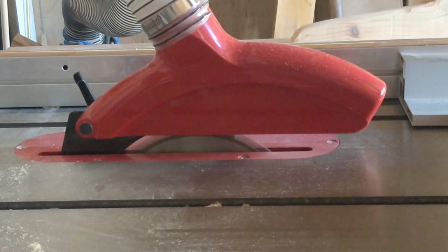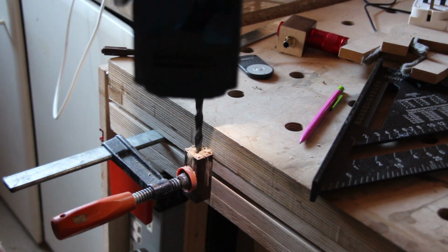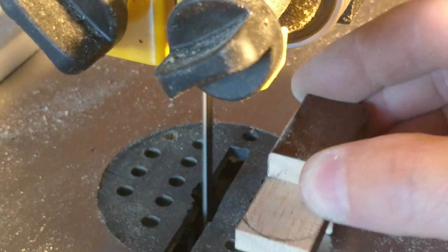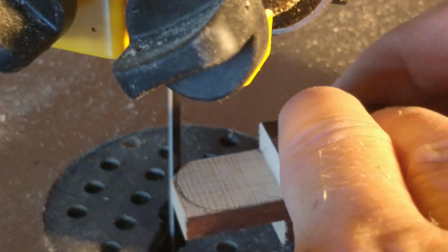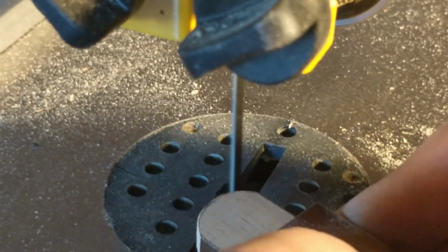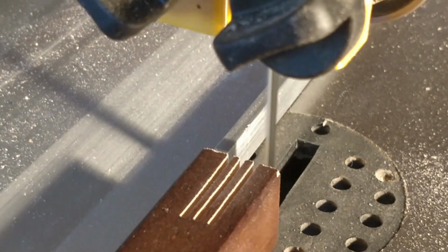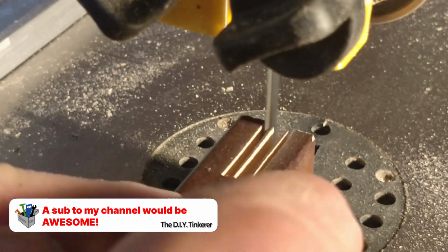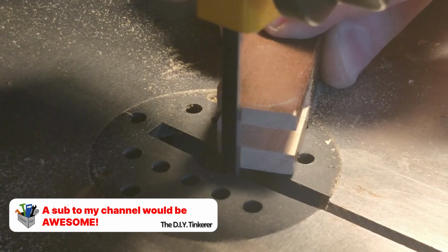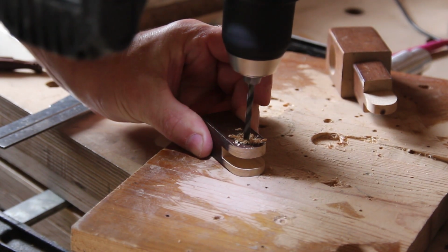Cut some more pieces from scrap wood on my table saw. In one of these I drill a hole in the end to accept the tubing and cut the male part of a moving bridle joint and then shape it so it will be able to rotate in the joint. I now cut the female part of the joint, hogging it out using the bandsaw and then shaping it. I then drill a hole for the bolt which will form the joint in both pieces.